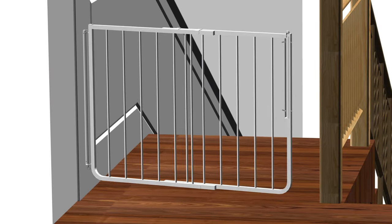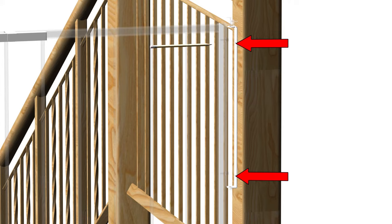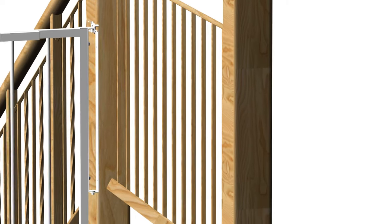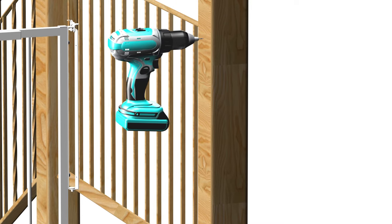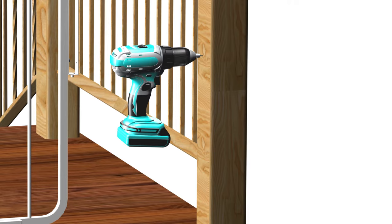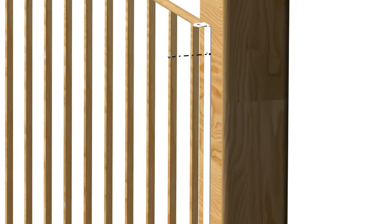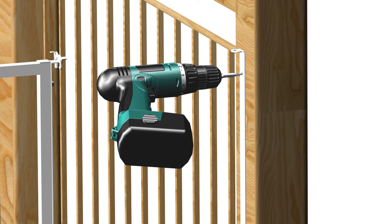Next, slide the gate out to the wall and place Part H latch bracket flat against the wall. Using a pencil, mark the location of both the top and bottom holes. Slide the gate back out of the way, and using a drill, drill two pilot holes on the marked locations. Unmount the latch bracket Part H, and place the back of the bracket flush against the wall, matching the drilled holes. If you are installing the gate in wood, insert Part C Phillips screw and tighten the screws using the screwdriver.